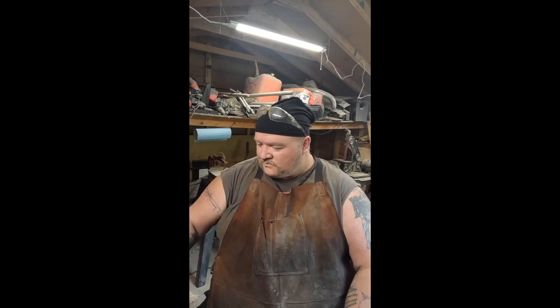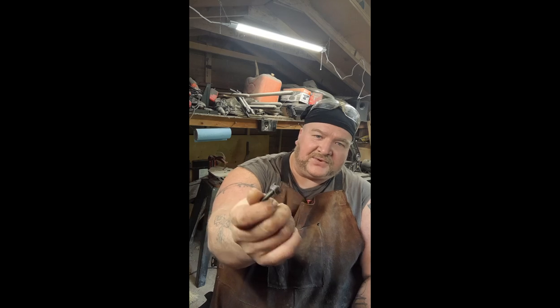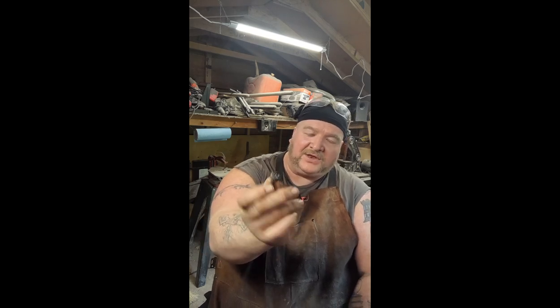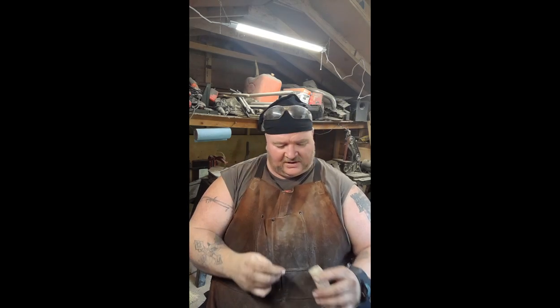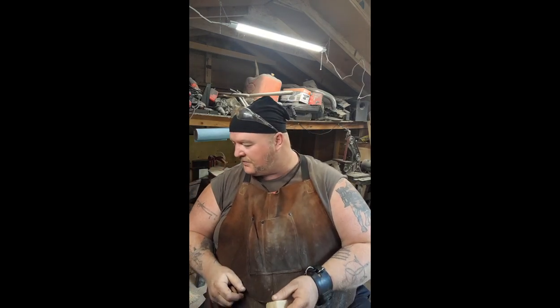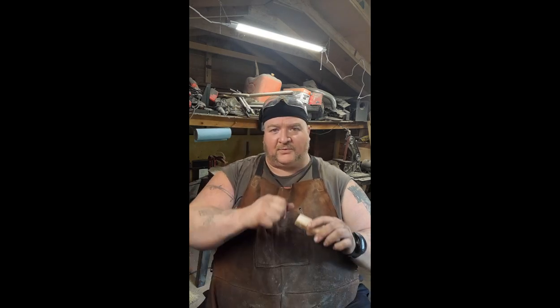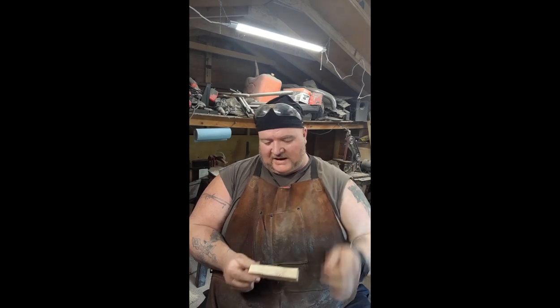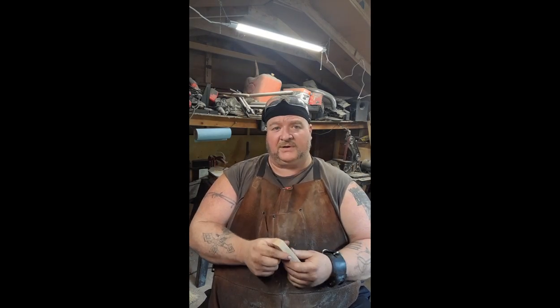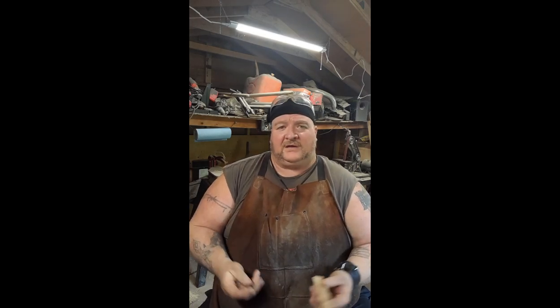So, one of the things that's changed is this here. The mini lathe didn't come with this. This is a spur bit, and what it does is it holds the wood. Now, what I had before basically looked like a little drill bit. Screwed it into it, but the problem I had was over time it was starting to loosen up and ended up with a hole in the air and it was just wobbling. So I'm hoping this will solve that. Videos I saw said it would.